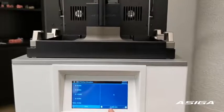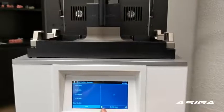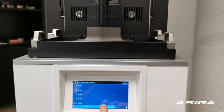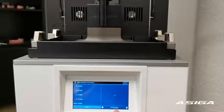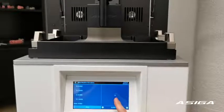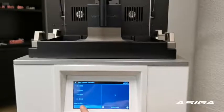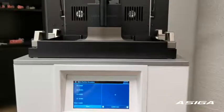You can see there's still a 1mm gap left between the build area and the build platform. We are now closing that gap by moving down the platform all the way until it steps to 0mm. It's important to see that the blue dot remains in the center without kicking out in any direction, and that the total weight is not going above 0.004 kg.